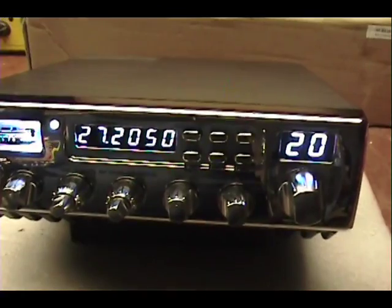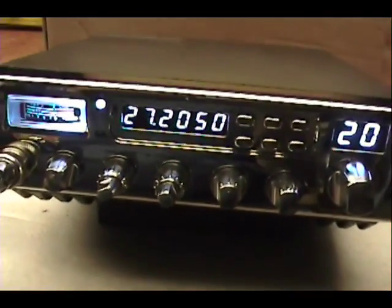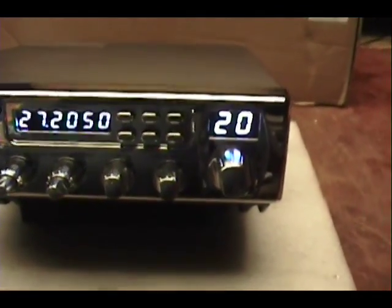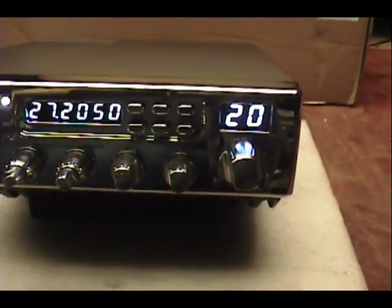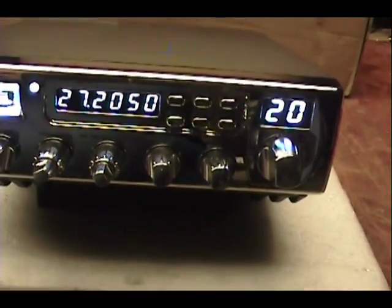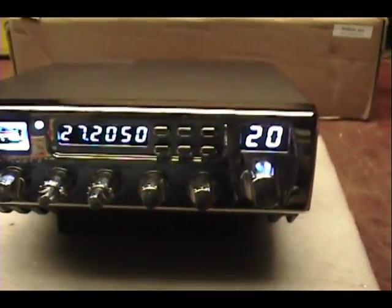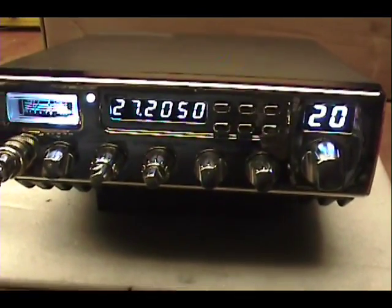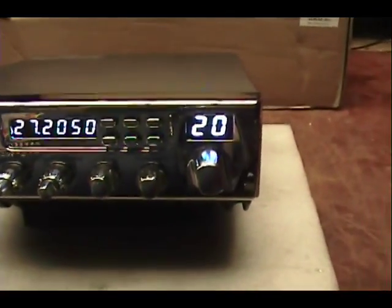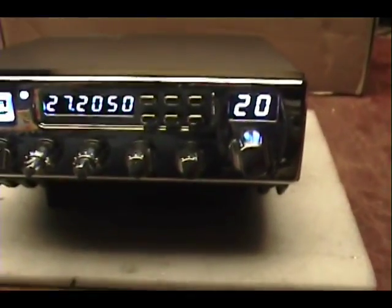They put a double final, and then they put the 4-pill 2879 amplifier in the bottom. The made in China 2879s. So I did some rework there to match them and get more power out. These units start out pretty low. Didn't even do four, not even close. And now I've got five out of it, so I was pretty happy with that.